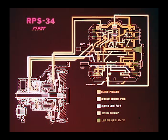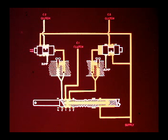In low, clutches C1 and C2 are engaged. The pressurized oil that actuated the C2 pilot was directed through the opened C2 retard check ball. When the selector lever is shifted to second, the C2 clutch must be released and the C3 clutch engaged. The pressurized oil that actuated the C2 pilot valve must be exhausted by the return spring force on the pilot. The pilot exhaust flow is restricted by the C2 retard needle valve, causing a delay in the return to closed position of the pilot. The purpose of this action is to retain the C2 clutch engagement until the C3 clutch is sufficiently engaged to pick up and carry the load.